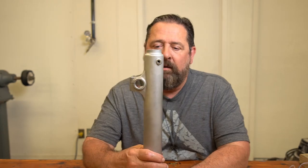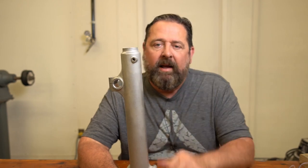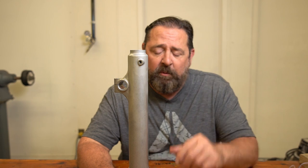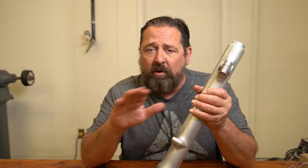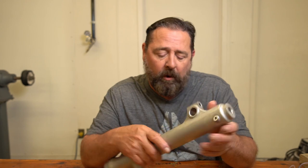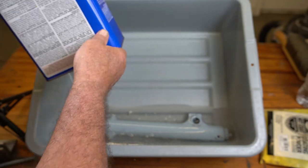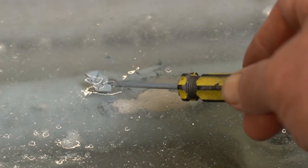I want to get on explaining how I do this. I've got this leg right here. I shot a video earlier today and it turned out wonderful, but I didn't have my audio on — so you'll see clips of me going back and forth, my lips will be moving but won't match the voice. Anyway, this stuff works fantastic if you've got the time for it to work. I put this in at eight o'clock last night and pulled it out at eight o'clock this morning. Within a few minutes of putting it into this little makeshift vat, the powder coat started coming off or wrinkling up.